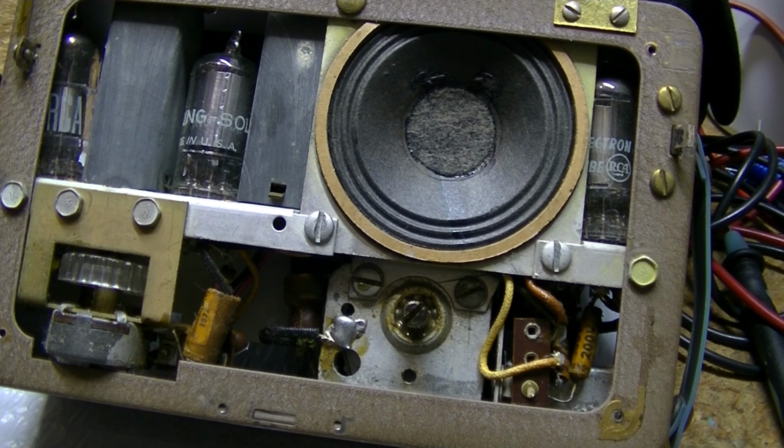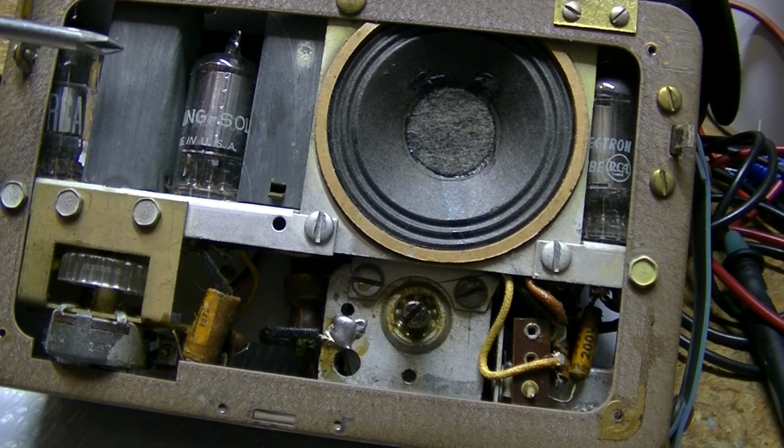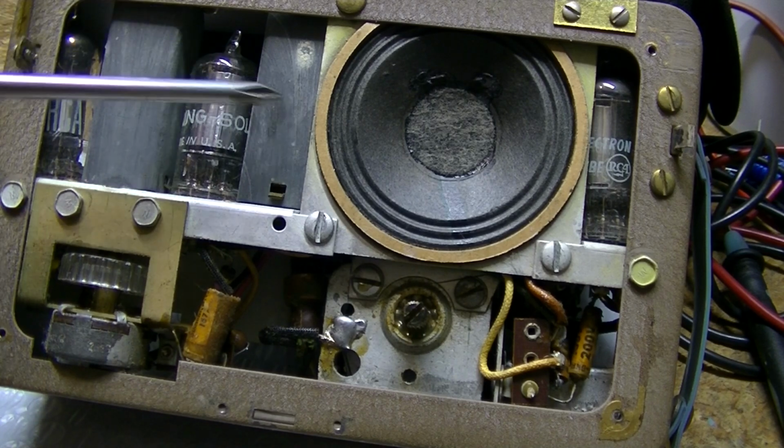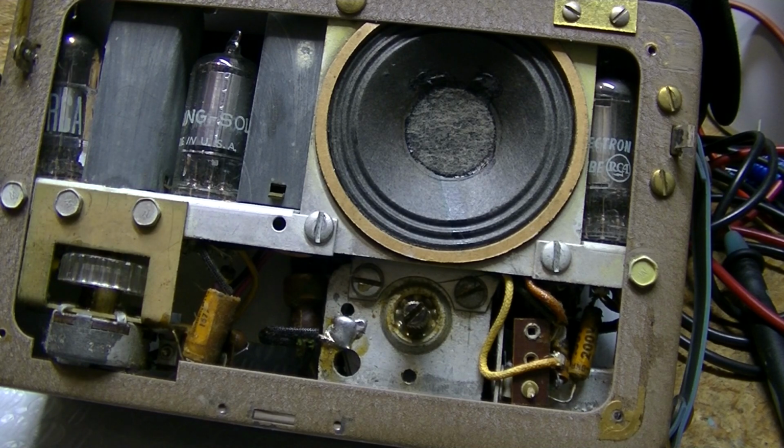My biggest worry, and I get people that ask me, and I mentioned it in this last video, why don't you just buy the 9-volt batteries? And I say that I don't want to invest in them right now. If either one of these IF cans go, and I know one of my viewers says it's very unlikely because it's very low voltage, you're dealing with 67.5 volts, and the radio hasn't been used in so long, that's unlikely to be silver mica disease. But I'm dead in the water if either one of these has silver mica disease or the coils are open.